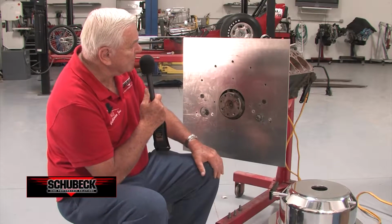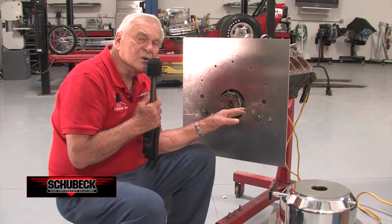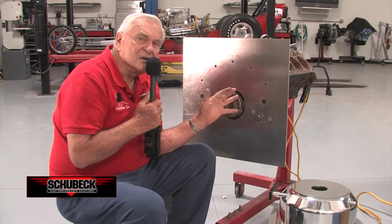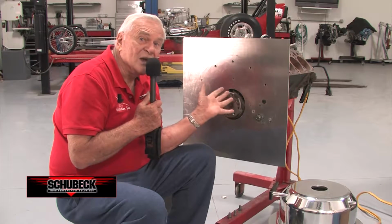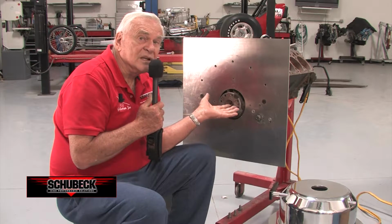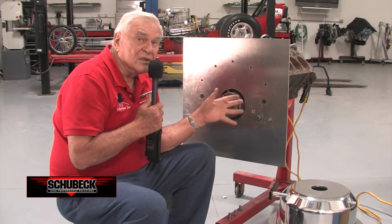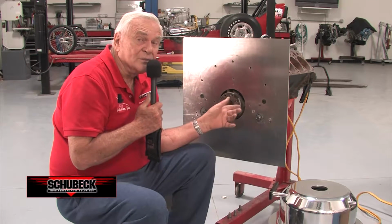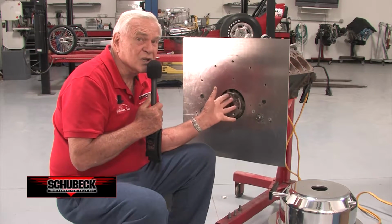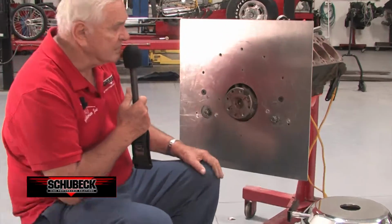Because just like the crew chief does, or the crew, when they put a big breaker bar on the front of the engine, they turn it over backwards where it has no compression strokes to it. And they do it that way so that if there's any residual nitromethane liquid lying in the cylinders from previous running, it'll come out without any compression and it'll go out the exhaust zoomies and drip out the bottom. We don't want to compress liquid, especially if it's nitromethane. It can be very, very volatile.